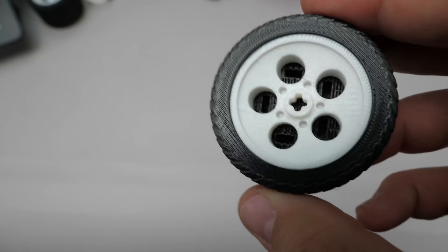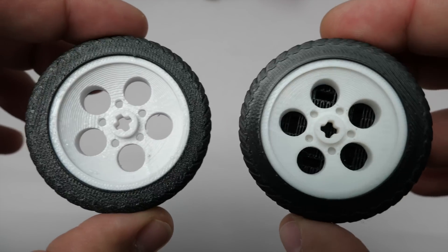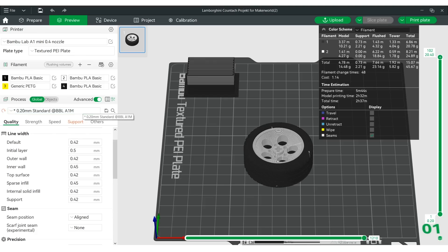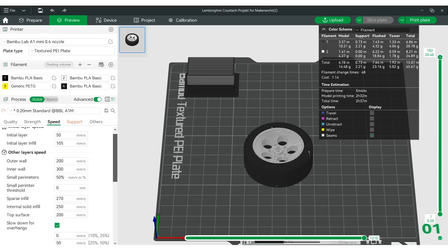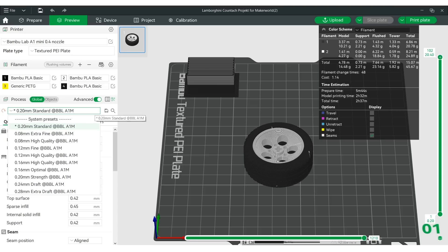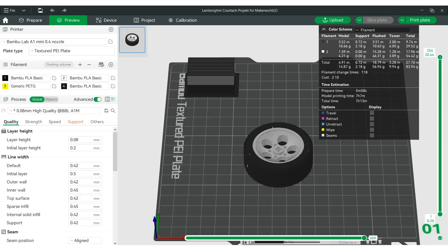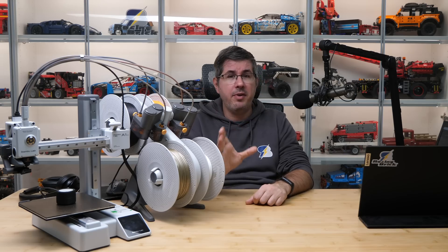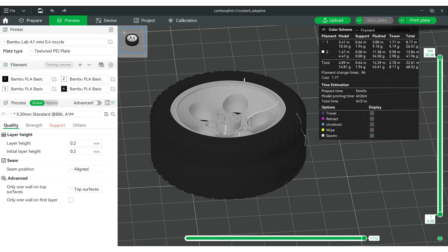The quality is pretty similar to what I received from Forward Stickers at the time. Some would describe it as good, others aren't happy with the detail and smoothness. Time to change the settings. I just used the predefined profiles for the printer, so I changed it to the finest quality with the lower layer height. As you can see, this drastically increases the printing time — we end up with over 7 hours. One method to optimize this is the use of adaptive layer height. Without going into the technical details, that print only took 4 and a half hours.